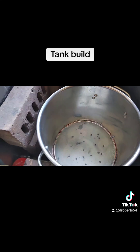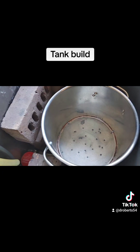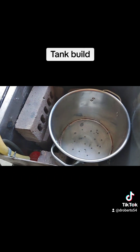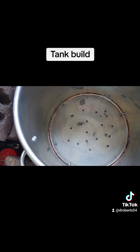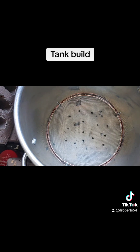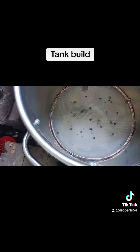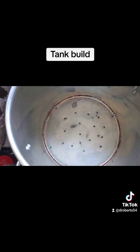You've also got your little catch pot here, which you use to wash your shot in. It's a simple $15 item from Walmart. Drill some holes in the bottom and put some screen wire in there. I've got a piece of welding rod in the bottom held in place with pop rivets to the side — that keeps the screen wire in place.